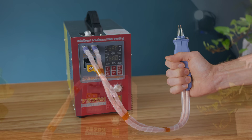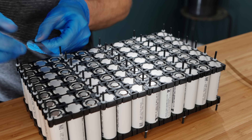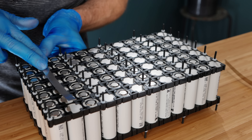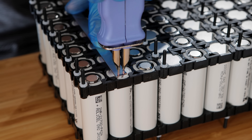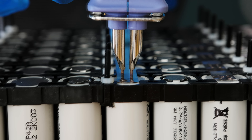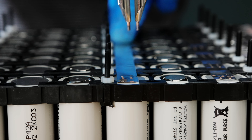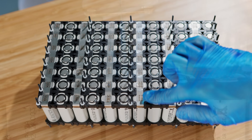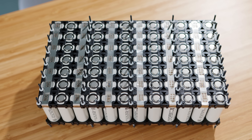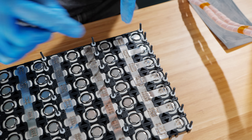This does basically the same job though it's got more settings, has the ability to do rapid burst welds, and of course has a higher power capability. A lot of care needs to be taken when welding these strips in place though, as one wrong move or even just dropping a strip on top of the exposed battery contacts could be disastrous. So if you ever build something like this yourself, make sure that there are no distractions around — not even music — and quadruple check every placement of each strip before welding them to the cells. To keep things ordered, I've welded up all of the parallel connections first along the negative terminals of each row, with the top end of each strip being folded over the side for easy wiring of the balance cables.